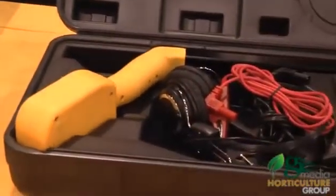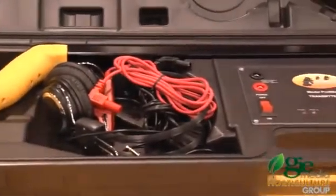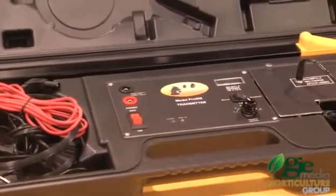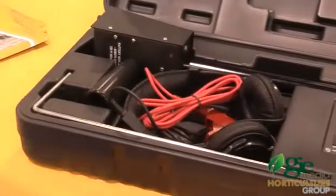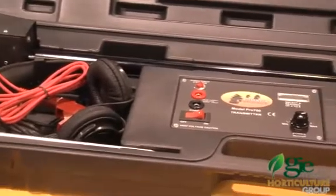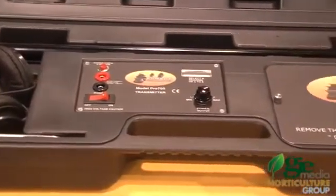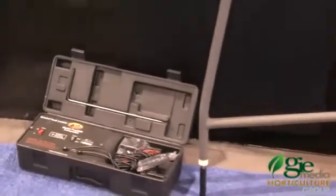We've put in a mode that we call broadcast or wireless connection. Normally with a wire and valve locator you have to actually connect the transmitter to your cable. We don't have to do that — you can just set the cable locator on the path of the cable on top of the soil or the grass, and the transmission signal is radiated or induced into the cable. You can track for a couple of hundred yards, the signal will die, you pick up your transmitter, go to your new spot and keep going. We call that leapfrogging — you could leapfrog from here to Cleveland if you wanted to on a cable.